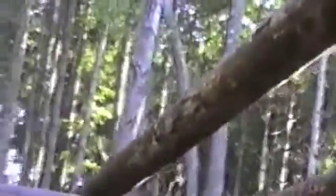And again, this is the ridgepole. It's about 18 inches in diameter on the big end, and about 14 on the other end. And it'll be setting on the top of that sucker, 35 feet from the ground approximately. And I'm going to have to use a chain block to get them up. My crane won't lift that high.